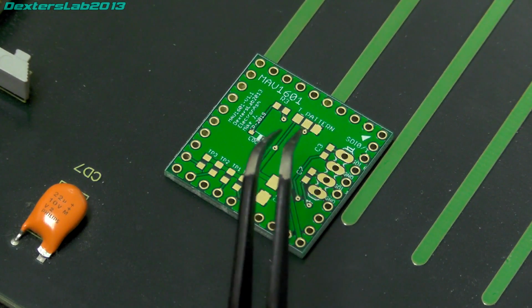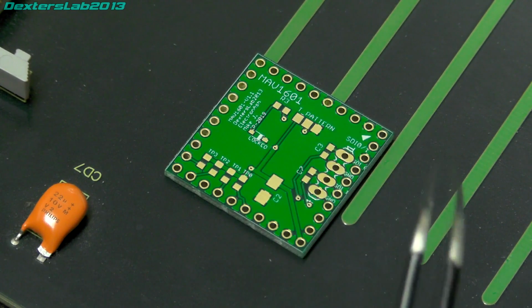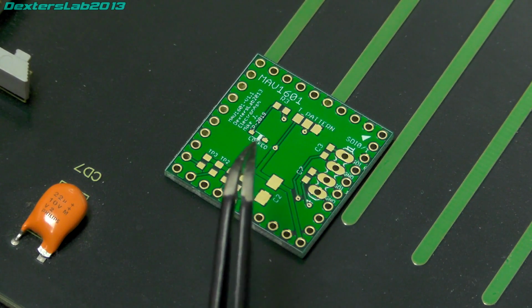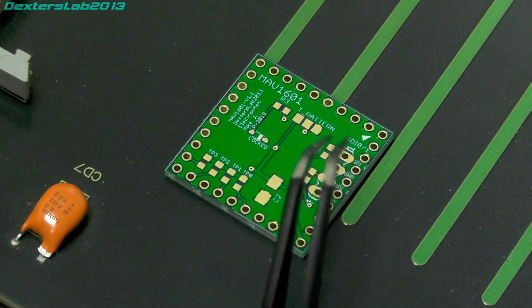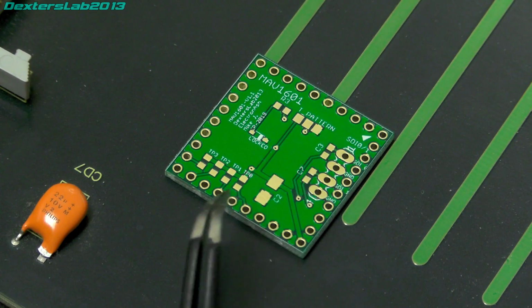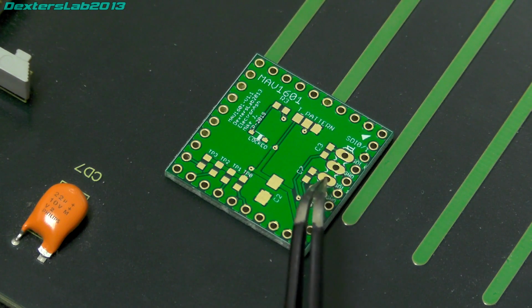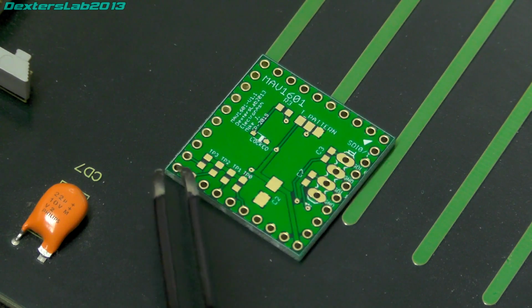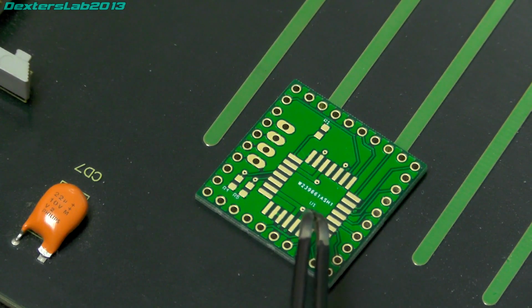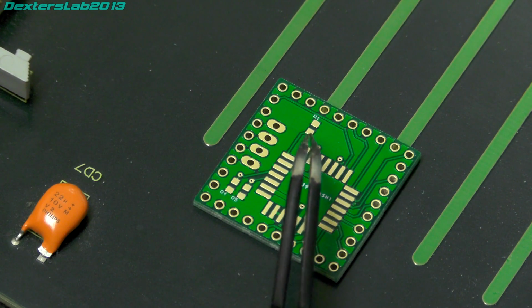So obviously we're just matching up all the connections that would have been on the 1601 to the CLC 020. We've got power coming in, we've got some decoupling capacitors, we have an LED for signal lock, that's just here. I don't actually have an LED of that size at the moment, so I probably won't add that in for the time being. We've got a test pattern pad to enable the test pattern generator. These four are the pads that define what the test pattern will be. We have two SDI outputs. There's two capacitors here used for decoupling on the actual SDI outputs. If I just flip this over, we have the actual footprint of the CLC 020, a couple of resistors here providing termination for the SDI outputs,